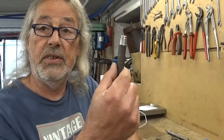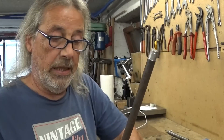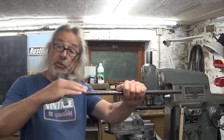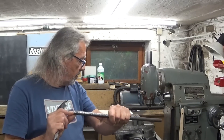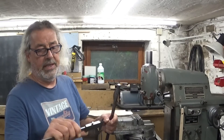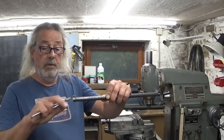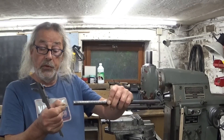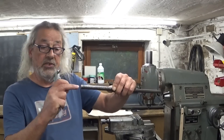The outer diameter is exactly the diameter I wanted, so I'm not going to turn it anymore. I'll just cut off this test cut piece and move over to the milling machine. First I'll create a flat spot where the little insert will sit. The bar is 15mm — cut out about half, so 7.5mm. The thickness of my little insert is 4mm, take that in half: 2mm. So I will cut more or less 5.5mm deep, and this will be more or less the top of the insert. Then I'll cut a pocket that will be 2mm deeper than the center of the bar.